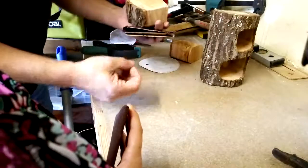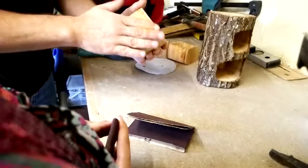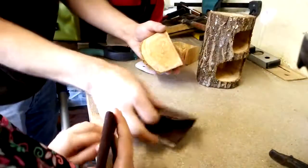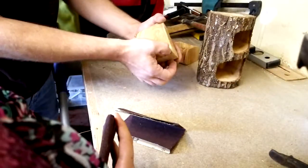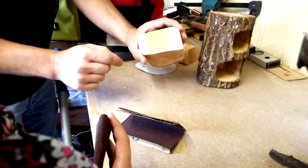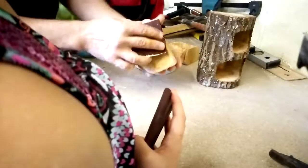So when I do stuff like this, sometimes I use a clear paint — like a clear lacquer. I'll sand off a clean surface and I use the dust from sanding, I'll mix that with glue, and then I use that as my putty so that it matches the color. Because every wood has a different color — this piece has at least four different colors on it. So I try to keep the dust from when I sand, mix it with glue, and use that as the putty so you can't really see the line that good.